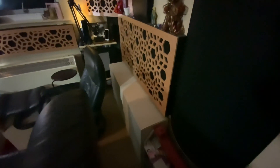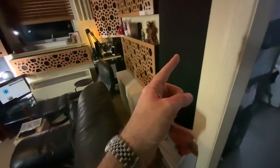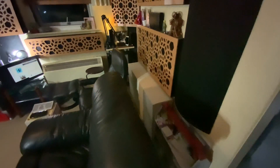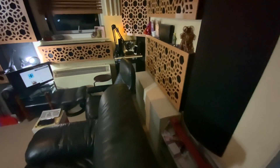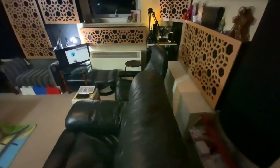Presumably his expectations weren't met, but I had a pretty good idea what I wanted to do in this room and had planned it out — these were part of the plan, though in a slightly different orientation. I originally anticipated they'd go here and here stacked on top of each other, but after pressure mapping the room, that is where the pressure was, so that is where they've got to go. They're activated by pressure, and pressure is at its highest on a wall — air velocity is at its highest as it reaches the wall, where it reaches zero, but it's pressing on something, so the pressure is at its highest at a boundary. Their official name is Scopus T40 membrane traps; they're diaphragmatic absorbers tuned to 40 hertz with a very narrow range, probably less than half an octave.